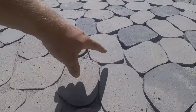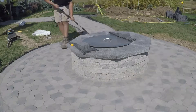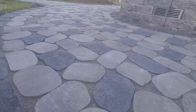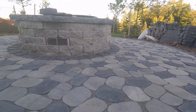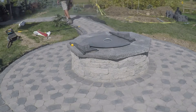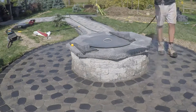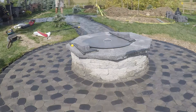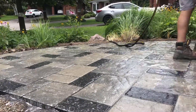Consolidation is a crucial step and should never be overlooked. This may need to be repeated — sweep in, consolidate, sweep in, consolidate — to ensure that the polymeric sand reaches to an eighth of an inch below the top of the paver or below the bottom of the chamfer. You do not want to install polymeric sand all the way to the top of the paver. The next step is blowing off that polymeric sand, making sure you get all the dust and residue off so it doesn't harden to the surface. Finally, the activation watering is a crucial step and you should follow the manufacturer's instructions, as every sand is different — this is a main point of failure in the process.